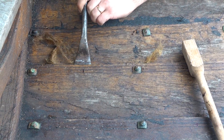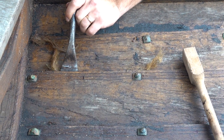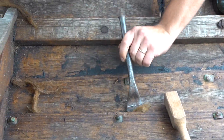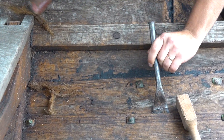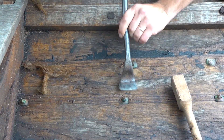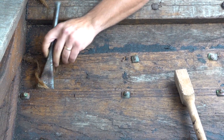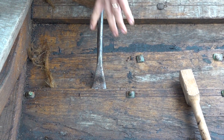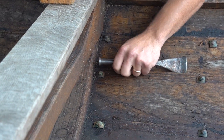You never want to do this — double tapping with the mallet. That's a sign you don't know what you're doing and it's highly looked down upon. No double taps — that's in combat only, not in boats. If you hear somebody caulking doing that, you should shame them. I'm just going to keep working along the seam. If you feel you're pushing too hard through, you'll feel it go through — and that's what you don't want to do. You just want to kind of set it.